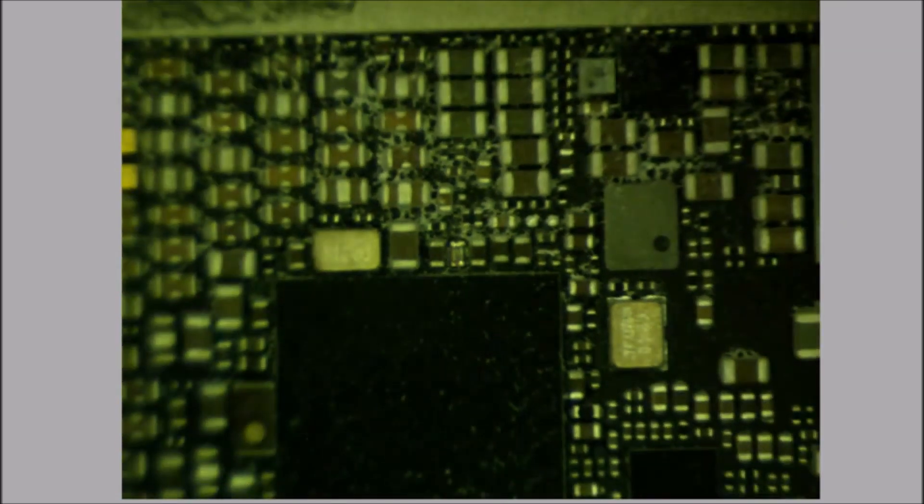Let's see if we can see anything in here that is hot. Nothing jumps out at me — and I'll be honest, I already know where I'm looking. Oh, there it goes — that just took a while. And there is our bad cap. He's the first and only guy to melt. So this is the guy that we are going to replace if we can figure out what he is. One bad little dude can make the whole bus come to a stop.